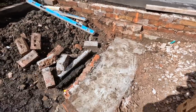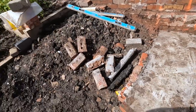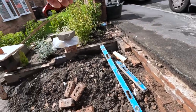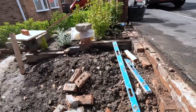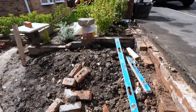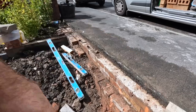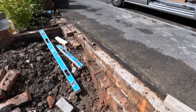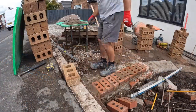When it gets to the end there where the arrow is, it comes square, it comes off there square, and then it turns. As you can see, the trammel's about 2 foot off the wall there. So square, and then the curve. So now I've got my lines, I'm going to get myself some brick here and I'm going to set a little cone up here, get this all set out and see where we're up to. So catch you in a bit.